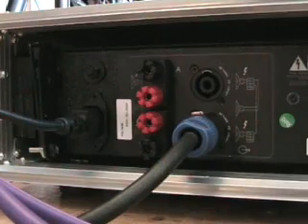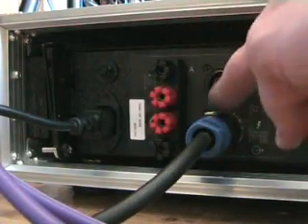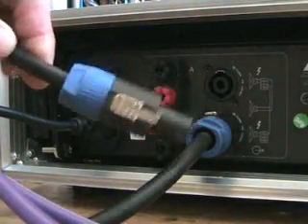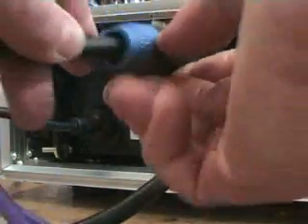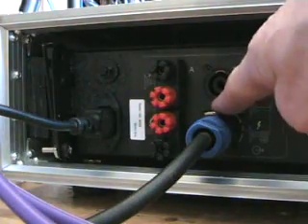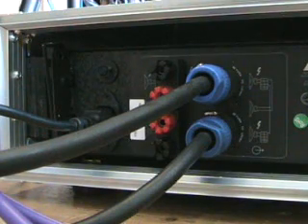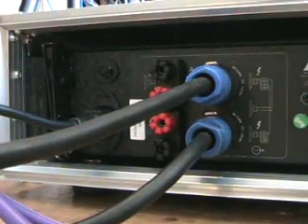Let me show you the back of the amplifier. That is where your power goes in. These are known as binding posts. These here are known as Speakon connectors. There's a Speakon connector — they do come in slightly different forms but that's the basic one. You can see a piece of metal on top, and you've got a fat piece of plastic and a thin piece of plastic. Inside, you've got a thin piece and a fat piece — that's where they fit. You push it in like so, and if you've done that and have no sound, it's because you haven't done the one last thing: twist. There you go — done.